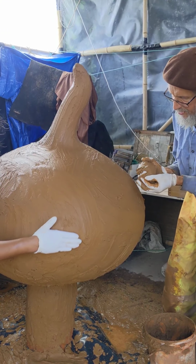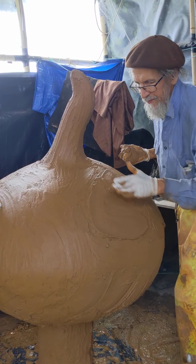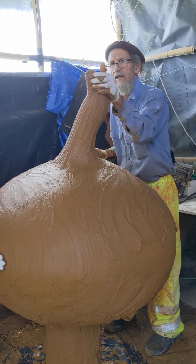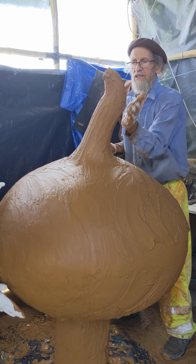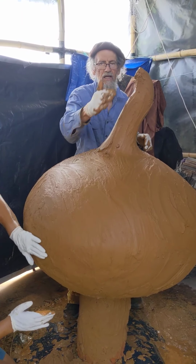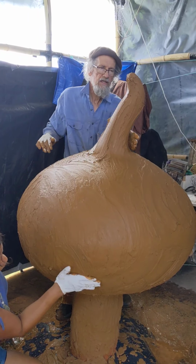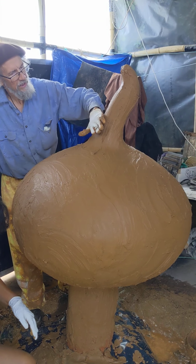So this is the finish that everyone sees and they judge us by. So we get quite tense about that, or I get quite tense. But it's going all right. When plaster's just a little bit starting to go off, that means that it's getting a little bit firmer. You can rub it a bit more firmly with the latex gloves and get a bit more smooth texture.